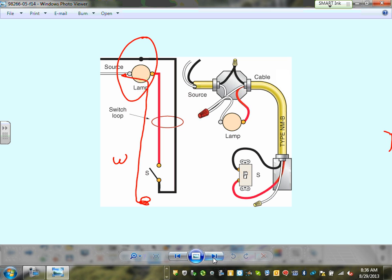Only if you are wiring with cables, only if the walls are closed, sheetrocked, with no access from the top or the bottom, are you required to bring a neutral conductor to the switch. Can I just get you to understand that? Because of that change in 2011, every switch loop like this has to be 14-3. In the past, we could have gotten away with 14-2. Every one of these has to be 14-3. Can I just get you guys to understand how this is a major change?